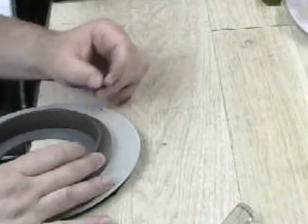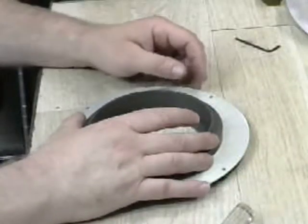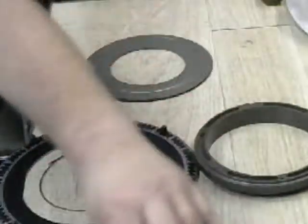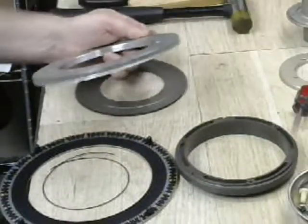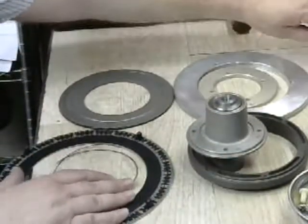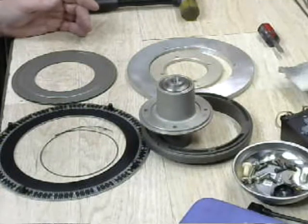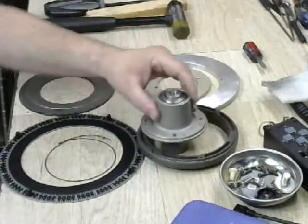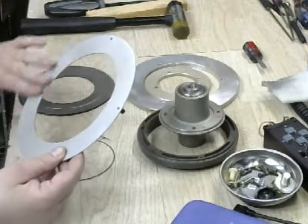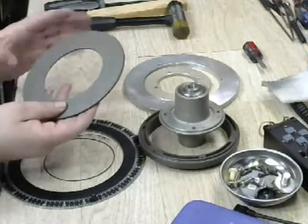Let's take this screw out again. Spring. So let's look at all of what we have here now. So this is the entire right ascension assembly, okay? And like I said, there's going to be grease on all these various surfaces. There might be scratches, there might be damage. You never know. So all these should be cleaned up and polished if possible, degreased completely, get a nice, clean, flat, smooth surface on everything.